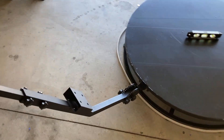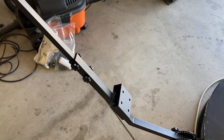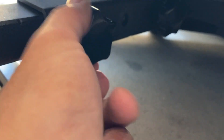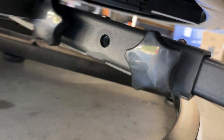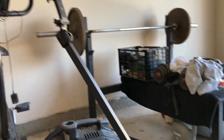Next thing you want to do is your arm. It's extremely important — look how loose this is right now, and we don't want that. What we need to do is tie in this lever along with this lever, then work our way down and make sure all the levers are tight. I like putting one here and one at the very end and tying them. I'm going to tie in these two, and then these two on this side as well.